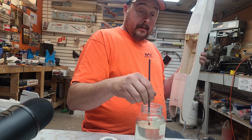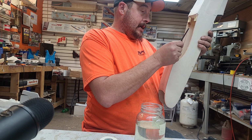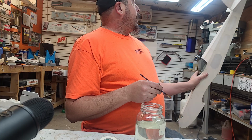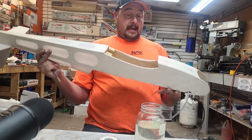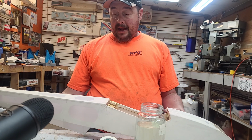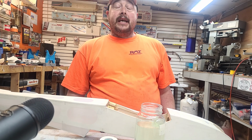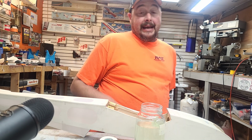I'm just doping that again, just to help make it a little bit stronger. All right. I think that is it, compadres. We're going to let that set for 24 hours, and then we'll blow it out. So that's how you address your seams and joints with Sig Koverall and pinking tape.